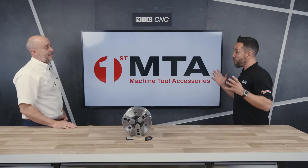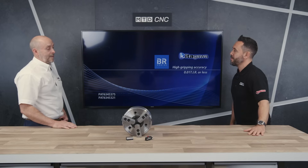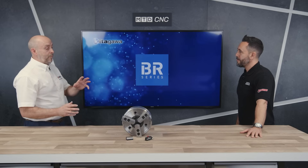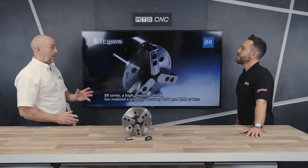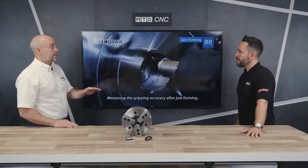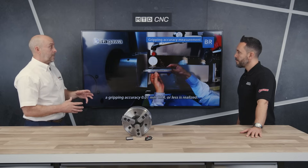Kitagawa Chucks — world-renowned chucks — what improvements could you have made? Well, what we've done is looked at our chucks and redesigned certain parts to give us better strength, better repeatability, and higher RPMs. We've redesigned the jaws themselves — the base jaw — so it's now a full-wedge system rather than the more parallel system it used to be. We've tried to make everything much tighter tolerance to give us much better accuracy.